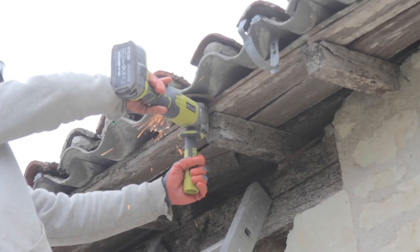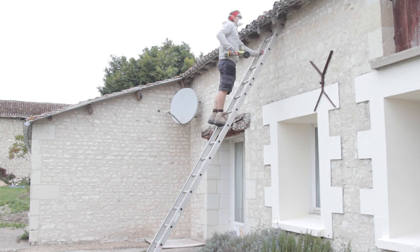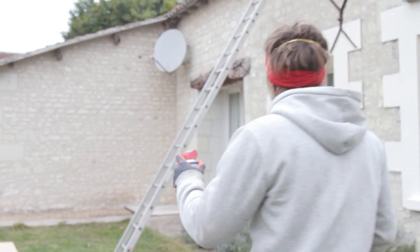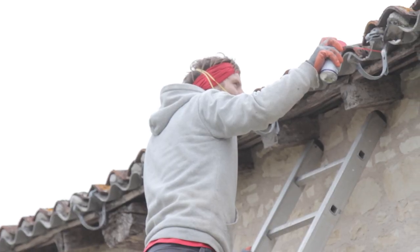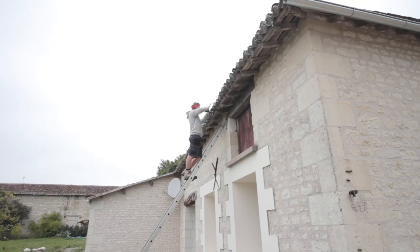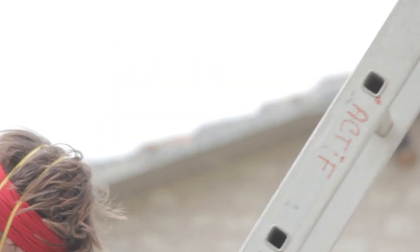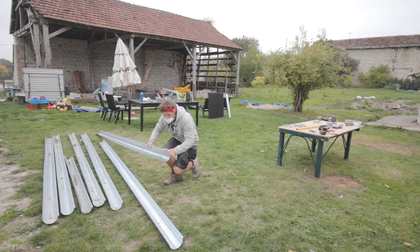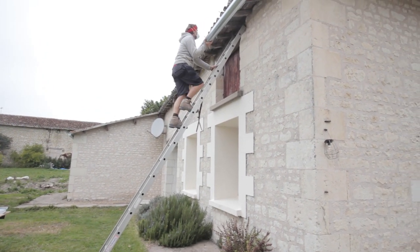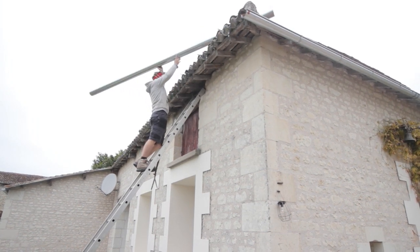The first job was to remove the old metal brackets with an angle grinder, making sure not to cut the sheeting. I wanted to reuse some of the fibro-cement brackets, however the nuts were a bit stiff — WD-40 to the rescue. I wasn't able to find these old-style brackets; the new ones you hammer or mallet into place. I got it the wrong way round — pivot!